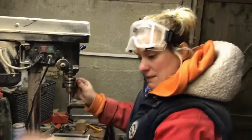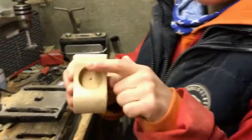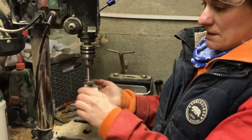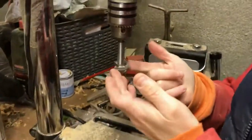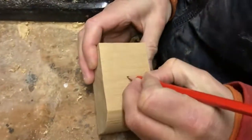This is the reason why we don't put the hole in for the peg while the wood is curved, because it will then jump around. The Forstner bit needs something to latch onto — it needs to centralize in that little hole. If you do it on the curved side, the bit catches first. So we're going to do it while it's flat.